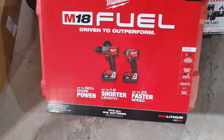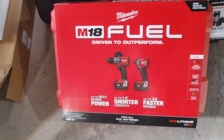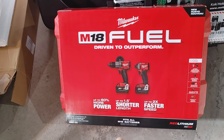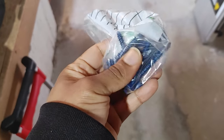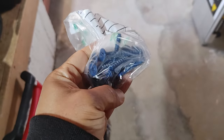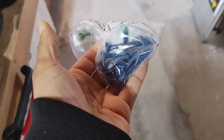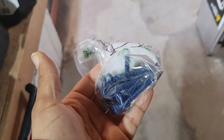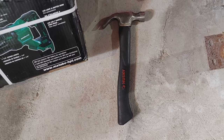You're going to need a hammer drill. I have a hammer drill and also a rotary concrete drilling drill, but it's still in the trailer so I'll get started with the hammer drill — a good opportunity to see the differences between the two. You're also going to need some concrete screws. I think they're one-and-a-quarter inch but I'll link to them. Follow the instructions since you might not get the same window. I only need four but I got twelve just in case.